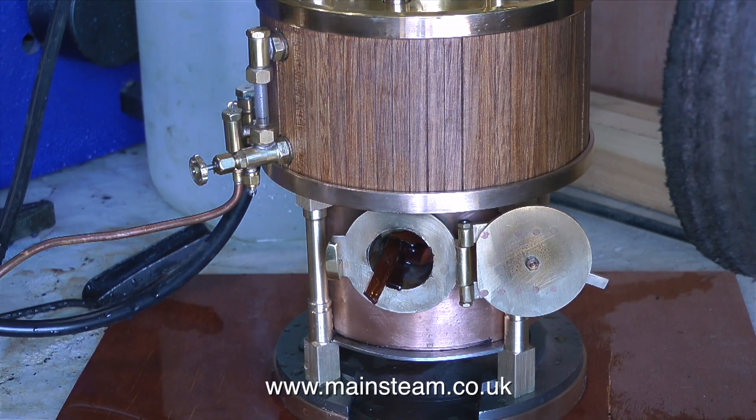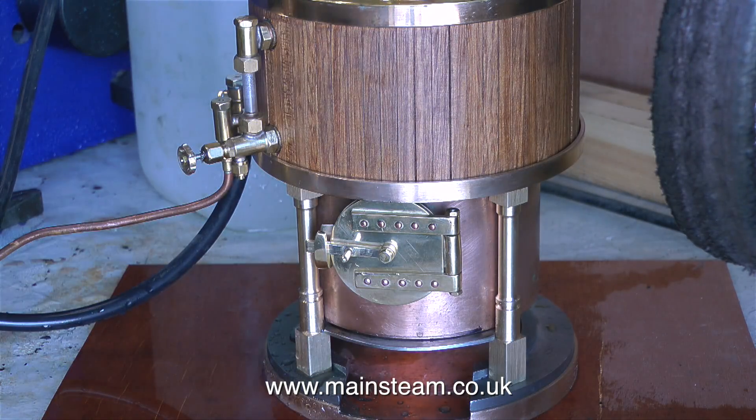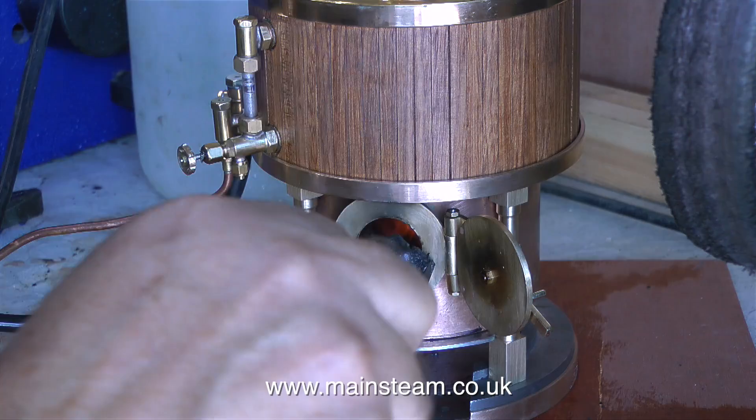What I should be doing now is keeping the firehole door shut at all times, and that way the air would enter through the holes in the bottom of the fire grate. The other problem is all this cold air rushing in through the firehole goes straight up through the tubes and cools the boiler down. By now you should have got the message that this is not the way to do it — but just in case you haven't, I'll put some more wood in the firehole. The water inside the boiler is now boiling slightly; if you look at the water gauge, you'll see the water level moving up and down.